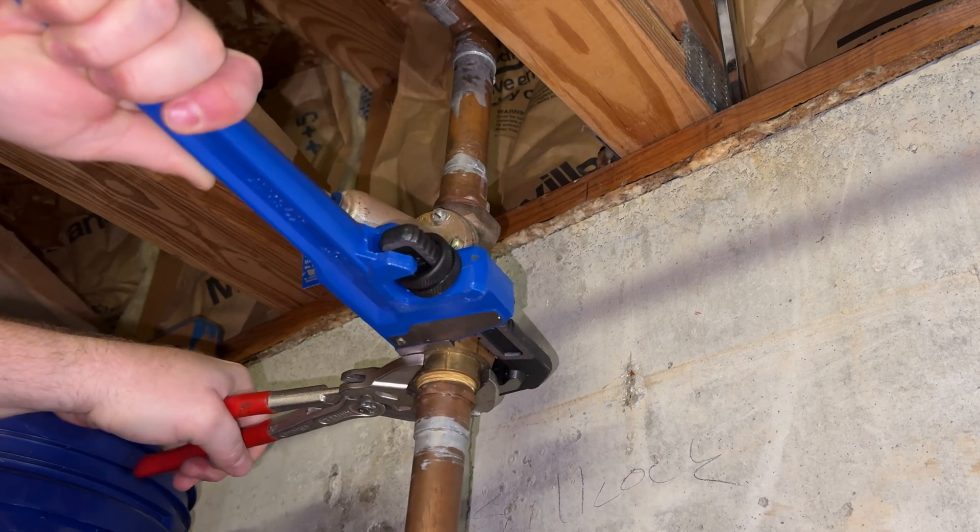For the top part you have a large rubber diaphragm right here, a metal washer that pushes on the rubber diaphragm, a spring to create the tension, and that spring is connected to the adjustable bolt on the housing. When I adjust this bolt in or out, all that does is adjust how much tension is on that spring, and that's what's holding that rubber gasket down. From my understanding, the pressure of the spring along with the water pressure pushes up against that rubber diaphragm, which is three times the diameter of the seat. When that lifts the top spring tension, the spring from the bottom plunger goes up and makes a seal. I challenge somebody to put a comment that explains it a lot better than I did, and I will pin my favorite comment to the top.